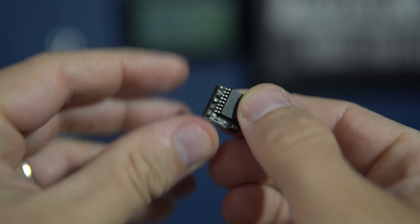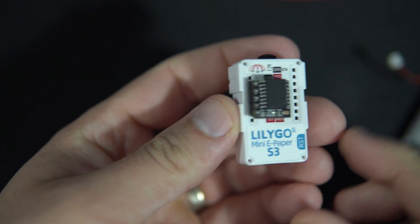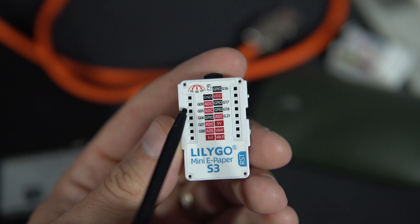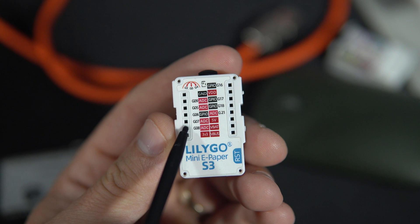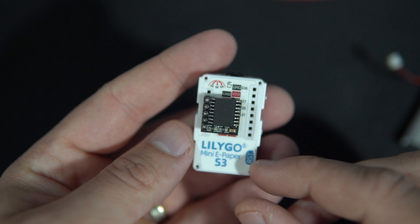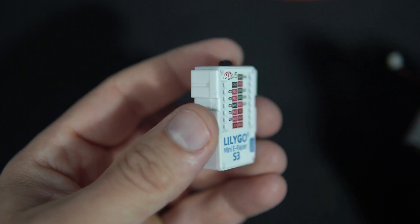This is an I2C module so it is easy to use, and the library is here. I will use GPIOs to power this real time clock — GPIO 9 will be used as ground and GPIO 8 will be VCC. This is not recommended, don't power anything using GPIO. But in this case it will work because this is a really low power module, so don't worry.